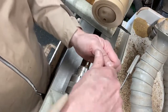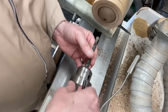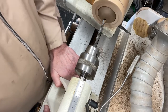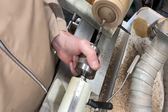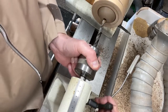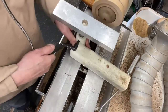I want to swap this drill - it's a little bit warm but not too bad. This is why I'm drilling slowly so it doesn't get too hot. Now this is a 9mm drill. I bring it up so the tip is almost in line with the parallel of the outside surface of the ball, then wind this in slowly - it's only taking a tiny amount off. Wind that to 15mm, take it out, move the tailstock out of the way. Then I have a flat platform set to the right height.